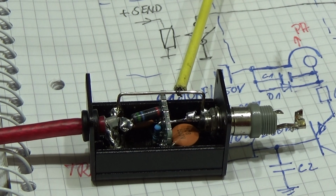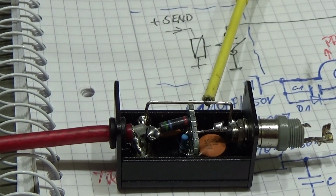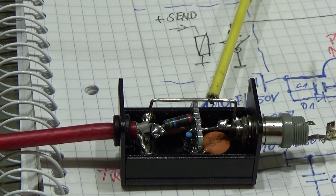But as I said, that is very seldom, and in 95% even really new radios, maybe the ICOM IC7300, does have a relay which is able to operate together with this little converter circuit, but even the IC7300 should not operate it directly into here our PA. So it does not happen very often that a modern radio only has a solid state transistor in between, because you know, these transistors only have a lower breakdown voltage, and therefore you need to be careful not to kill it. But as I said, very seldom.